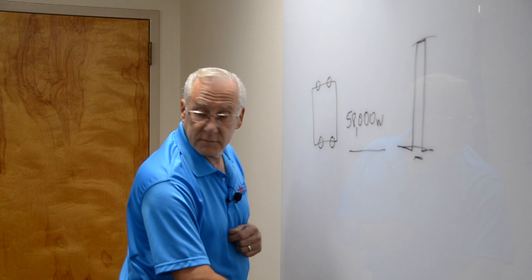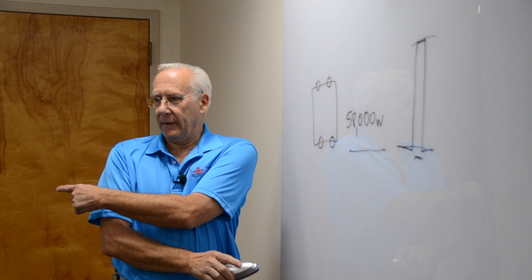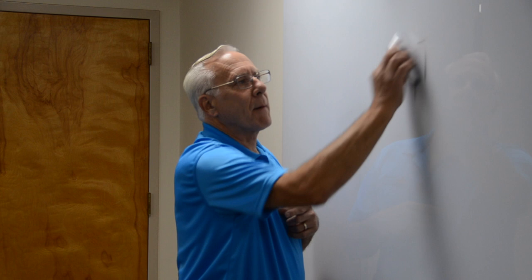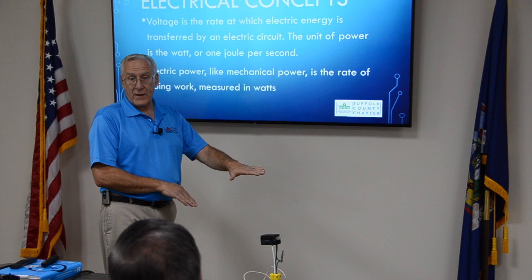Think about that. It's a lot of money. And it's not at 15 cents a kilowatt either. They charge a premium because of this. If you don't turn it on for a week, their power plant, they already added on to the power plant and you didn't turn it on. They're waiting for you to turn it on so that they can charge you. Demand metering. That's how most commercial meters operate. They operate on demand, not like your home, which you pay for every single kilowatt the same rate. In demand metering, you pay for that peak. So if you hit 58,000, they'll charge you the 58,000 rate. And it's more per kilowatt. If you got it down to 30,000, the rate would be less. That's how demand metering works.